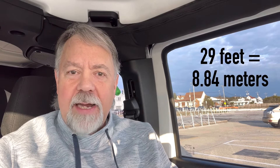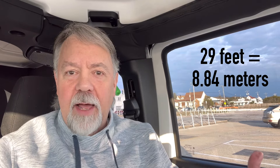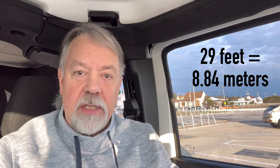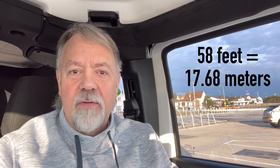With random wire antennas, your best lengths are 29 feet, 35 and a half feet, 41 feet, and 58 feet. I realized 29 feet twice is 58 — so two random lengths of 29 and 29 would also equal the 58-foot length. So that's the length I'm going to use to build this thing.